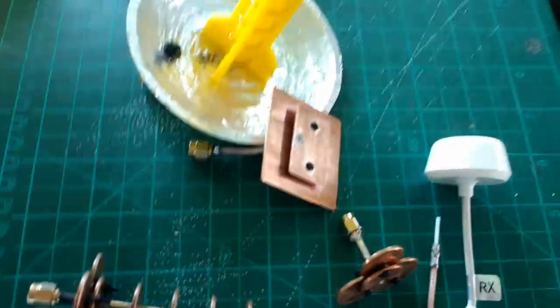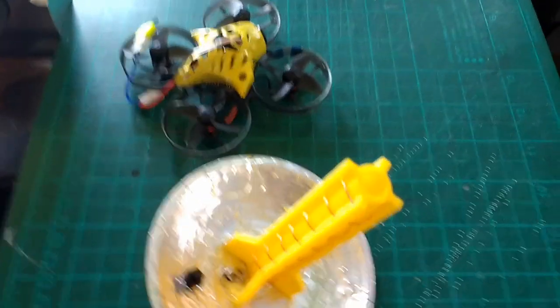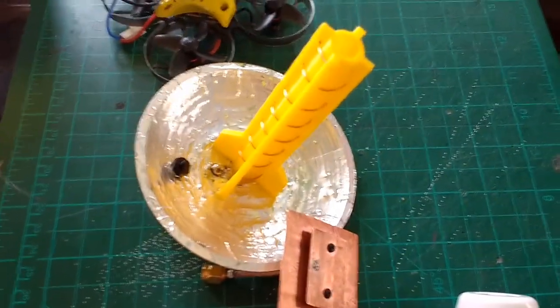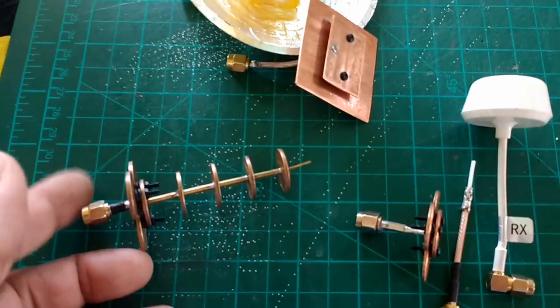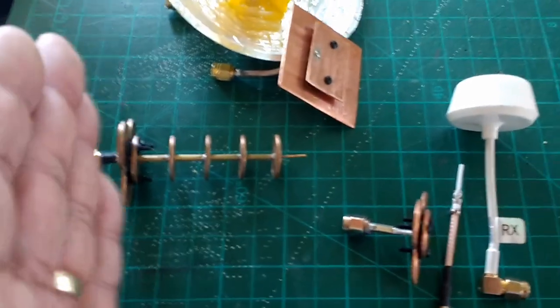I think the impedance on those cables is 50 ohms, if I'm not mistaken. So it's kind of in line with a lot of these things that are done around the 50 ohm impedance for matching purposes. The best antenna you can have is an antenna that radiates most of the energy forward and does not reflect anything back towards the source, which would be the signal generator, which in this case would be the transmitter. And that has to do with impedance matching.